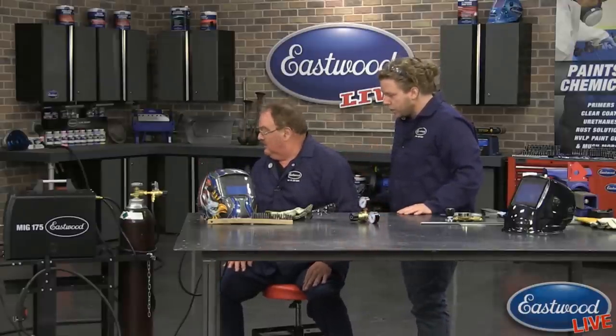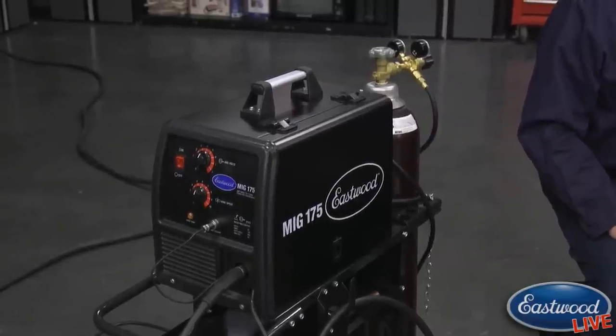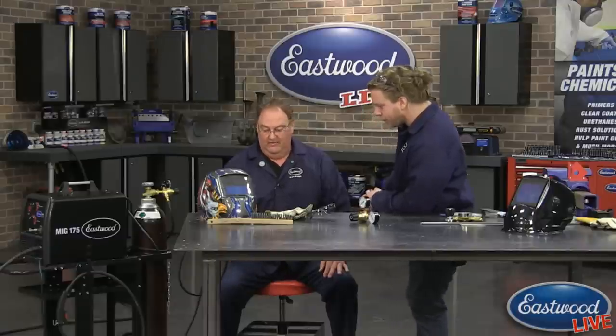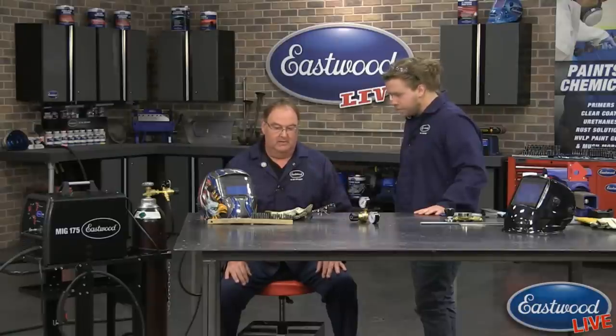Make sure you have fire extinguishers nearby — we have two in this room. Also make sure you're not welding near water. If you're welding outside, you may want to turn the gas up a little bit for more CFH, or put up a piece of cardboard or plywood as a barrier, because a breeze can blow away the shielding gas and defeat the purpose. One of the biggest safety problems in welding is tripping over objects. When you have your helmet on, you lose peripheral vision — so just be aware of your surroundings. Welding is a blast, I love it.